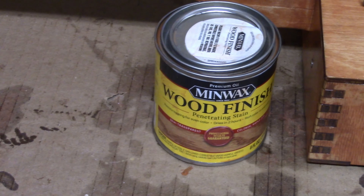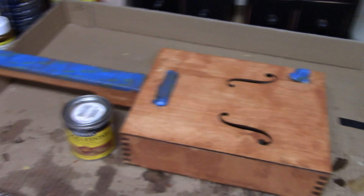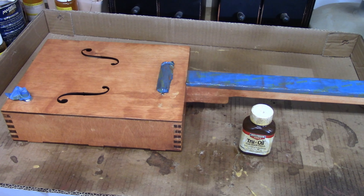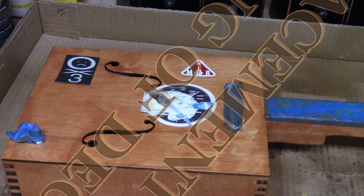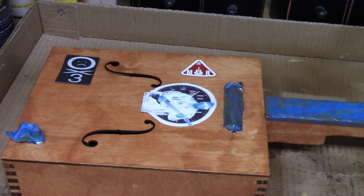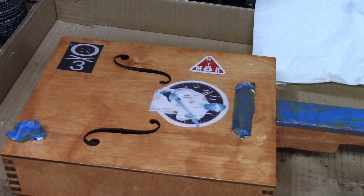The pickup and controls were covered with painter's tape. The guitar was sanded and then stained with four coats of colonial maple stain and six coats of true oil finish. Decals were placed on the guitar and then covered with six coats of crystal clear lacquer.